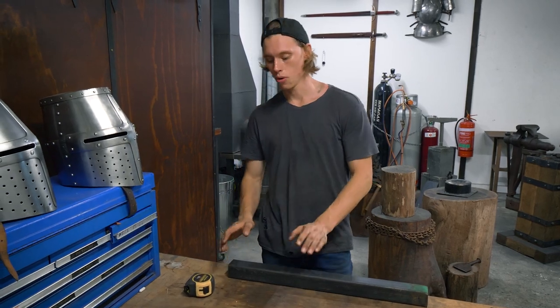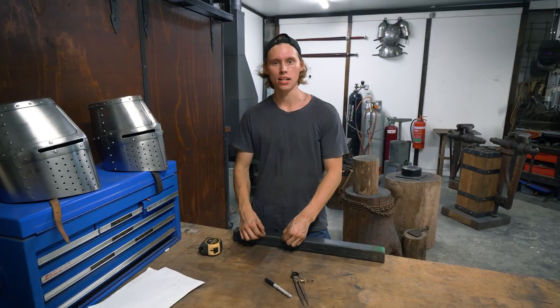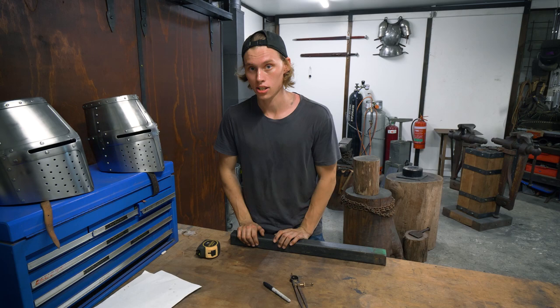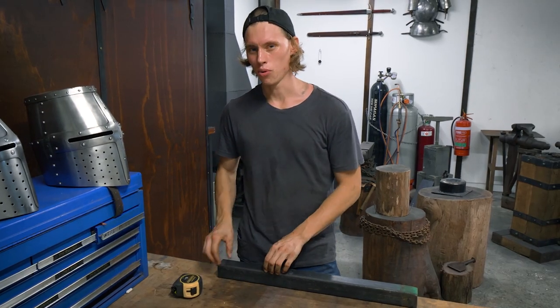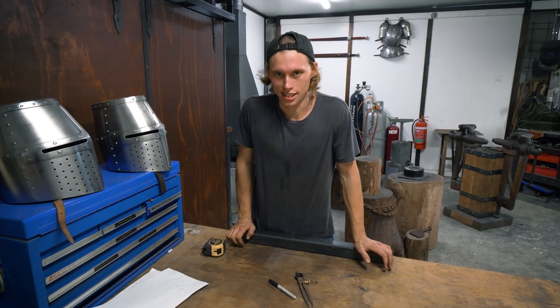This side of the stake we're going to keep the way it is. We might put a bit of a polish on it, but having that radius is good for when we're turning an edge to 90 degrees or trying to do something where we don't want a sharp extreme edge. So we've got options in this thing and that's really good.